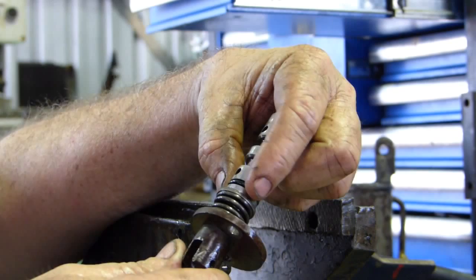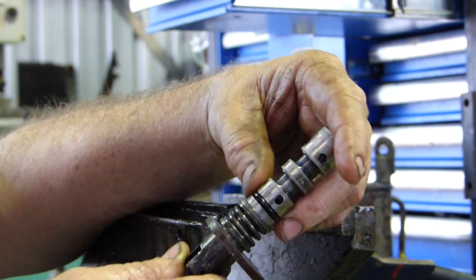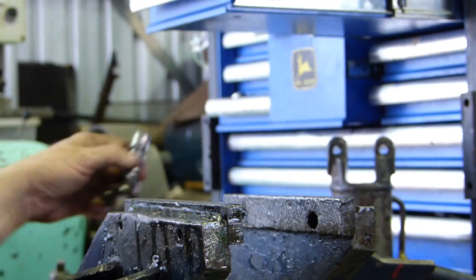I've put a new O-ring on the valve and we have good protrusion. The valve O-ring is about the same hardness as the one that came out. You've got to expect them to be a little bit softer since the old one has hardened over time, but that's reasonable — they do work hard and eventually crack. This part of the kit is fine, nothing wrong with it.